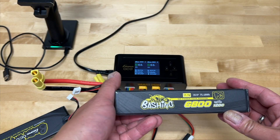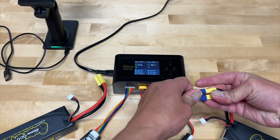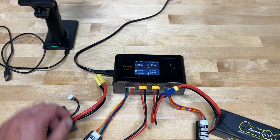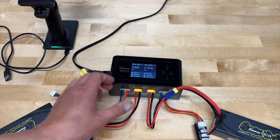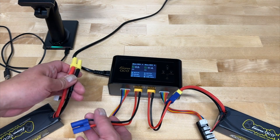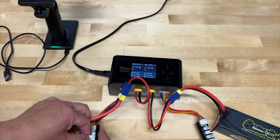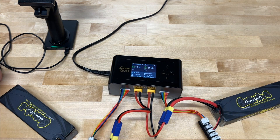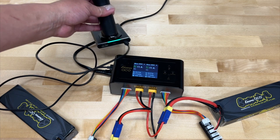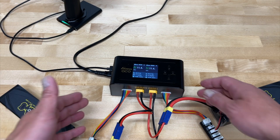I've got a couple of my bashing pro 11.1 volt 3S packs we're going to hook up. Pretty simple to do — just plug it into the supplied cables, plug them into the balance board, same thing over here. Make sure you do not mix these up — you definitely want these two wires connected to one battery and these two wires to the other battery. If you switch them you're going to have major problems detecting the individual cells correctly and you will probably start a fire. The charger also has a USB port, so if you've got something like a FlySky transmitter, your phone, or your GoPro, you can have that charging on the side — very convenient.